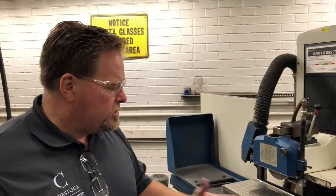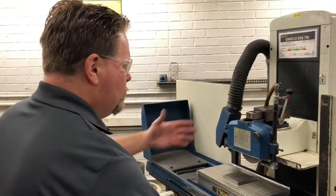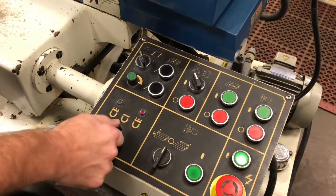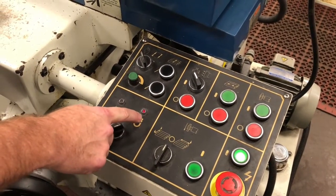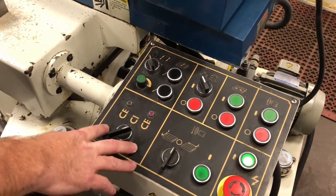Also, when I turn something on, I want to turn it on with my left hand so I'm facing away from the equipment, instead of my right hand where if I turn it on it blows up. So now I'm going to turn it into the on position. Do not go from D-mag to on, because that can be actually quite dangerous for the machine.